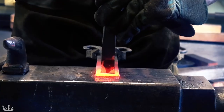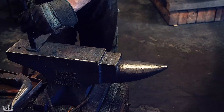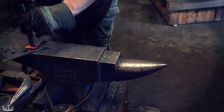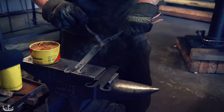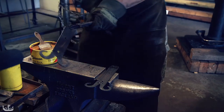The one part that is still missing is the hole through which the hinge eyelet can slide and travel. I am using a slot punch to create the initial hole. A drift is used to increase the hole's size. Once the protective finish of paste wax is applied, I move on to the lock straps.